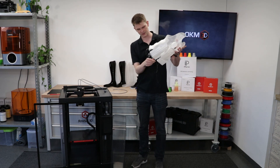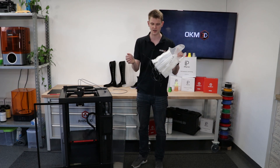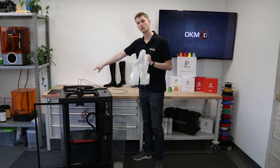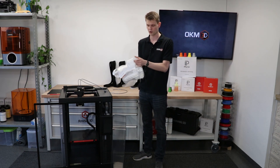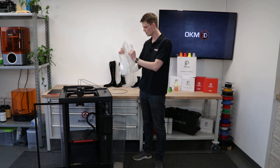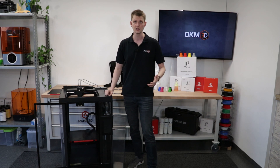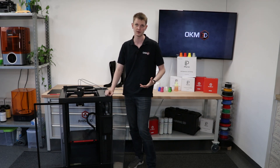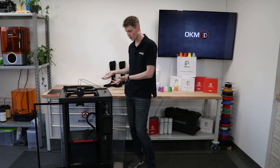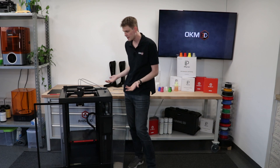There's a bit hanging around the sides from the support material. This is clear polypropylene along with that special support material. If I heated this up to about 110 degrees, I could just peel off all that support material. That's also why it was so stringy — to get it off the build plate, I heat up the P surface to a temperature very close to where that support material becomes chewing gum-like, which is why there's material hanging around, because the support got soft. This complete package is what we hope enables you to very easily print polypropylene at very high quality and reliability.